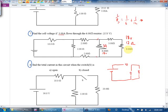1.5? Okay, 1.5 amps. And what that means is I got 3 amps going here. I got 1.5 amps going here. When they join together, how many amps are flowing through this resistor? 4.5. You with me so far, kiddo? Oh, and you know what? How many amps are flowing through this resistor? If they break up into 3 and 1.5, it's got to be 4.5 amps flowing through there, too. Oh, which means I know the voltage in both of these as well. If I go I times R, you know what the voltage drop is?